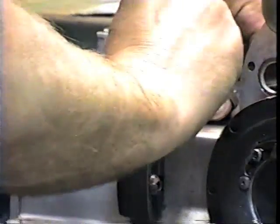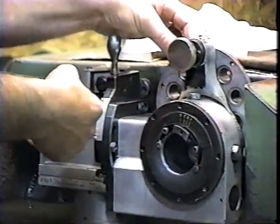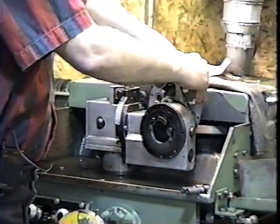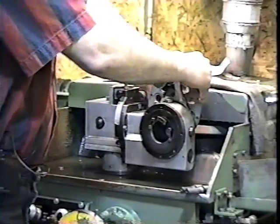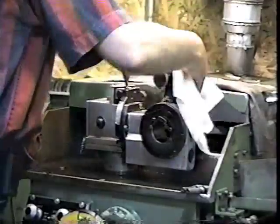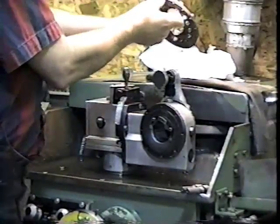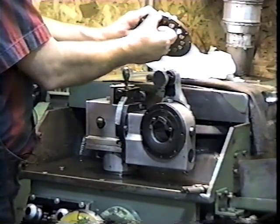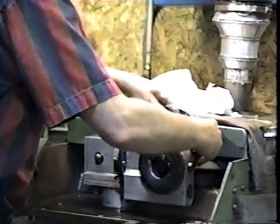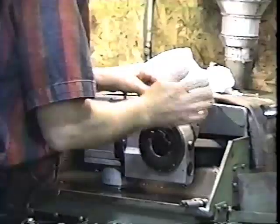Now I'm basically set up for 118 degree points. The next step is to change the bushing plate — that's what holds the drill in place while we're grinding it. I pull it back, turn it a little bit, take the guard off, and use the spring-loaded cam to remove it. I grab my other bushing plate which has the half-inch bushing on it. I always clean that off, clean the bore. The face of the device shows the various drill bushing sizes — the drill size is on top and the bushing on the bottom. I install it and turn the spring-loaded cam.